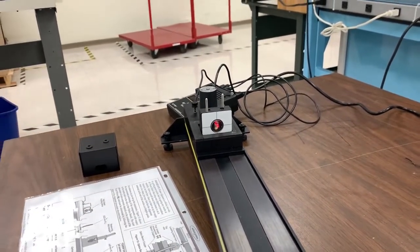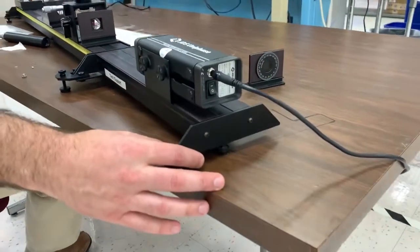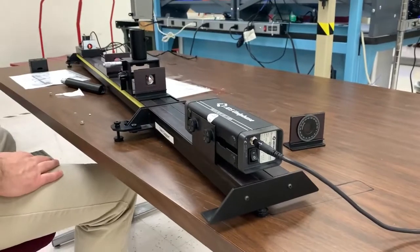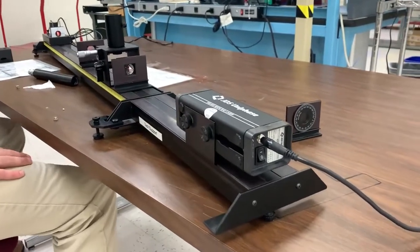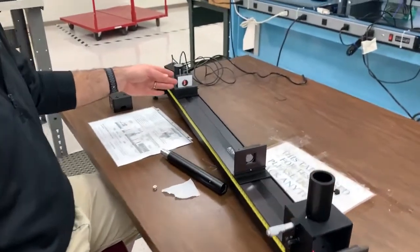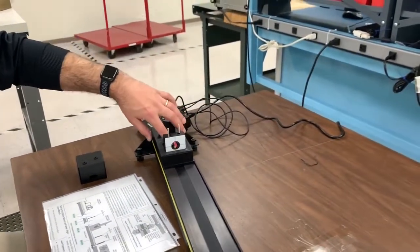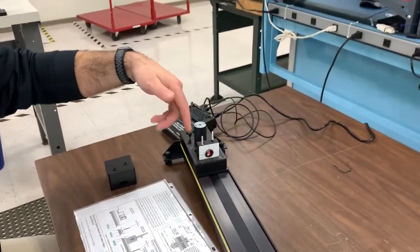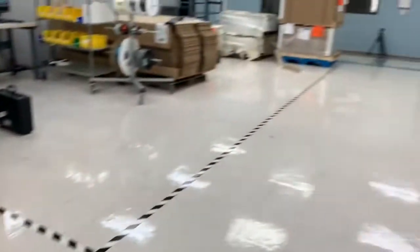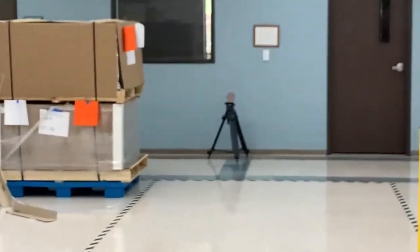You can do that by adjusting the foot on the back of this laser stage to adjust the angle at which the laser enters the system. Once the beam aligns on the back of that mirror, put your finger down to the flywheel and turn the mirror around so it faces out, and then send the beam off that mirror down to the fixed mirror some distance away.